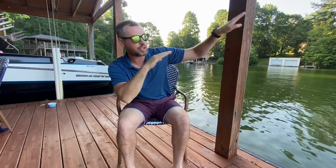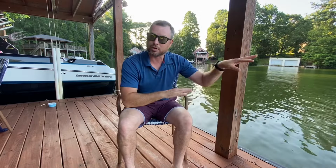And what happens is in the summer, when the sun is more directly overhead due to the angle of the earth, you'll get shading on those windows. But in the winter, when the sun is at a shallower angle all day long, those overhangs won't affect the sunlight, and the sunlight will actually just come in through the windows. So in the summer, you'll get shading on those windows, and in the winter, you'll get the passive solar heating